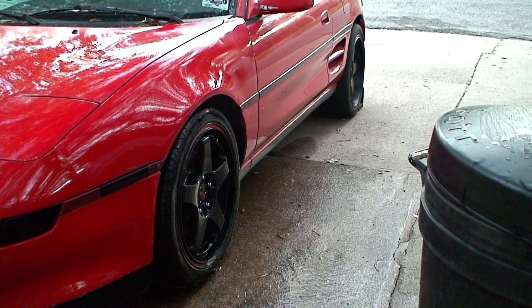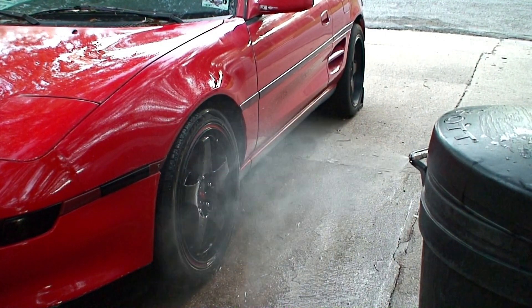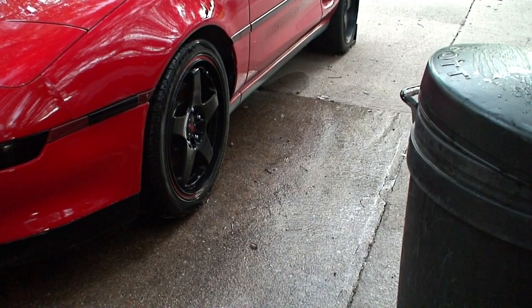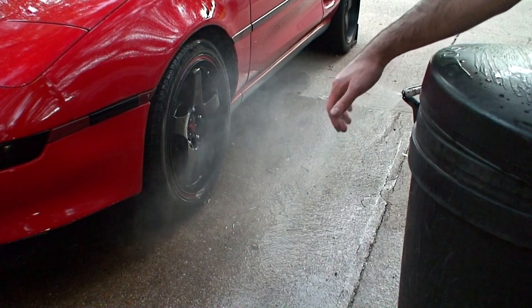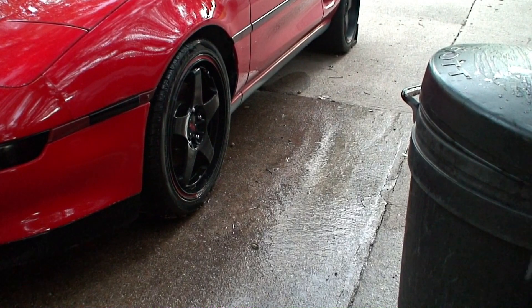Now the CM10 nozzle from Cooling Mist — the 10 gallon per hour. The spray angle is in between the B-Cool and the Devil's Own. It also seems to have very fine atomization; feeling it, it's much finer than the past two and feels more even. It doesn't spray as far as the last two, and I think that's because it's atomizing much better — the droplets are smaller, which I can feel when I put my hand in the spray. It definitely feels like a finer, smoother mist. Between all tested so far, this one is definitely the finest and probably the one I would use.